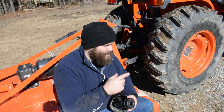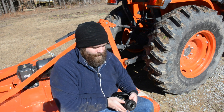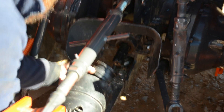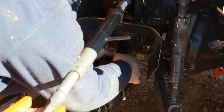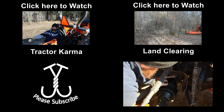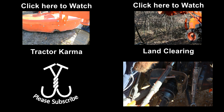Then I discovered I can do this — the front half of the collar comes back and that releases the bearings. So I'm gonna slide this PTO back on and get back to work. Just in case somebody else ever has this problem: don't try adjusting this collar from the back — adjust it from the front. When I pushed this collar forward and tried to slide it on, nothing was happening. But now if I pull this collar back, it went on just like a show-on.